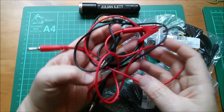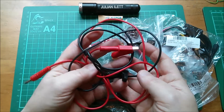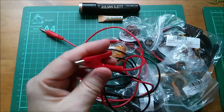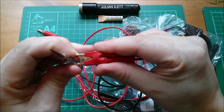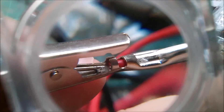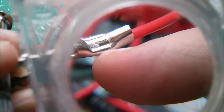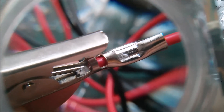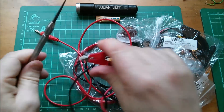Next item is this pair of banana plug on one end and croc clip on the other end leads. I've actually used these to charge up a super capacitor and they seem to work quite well. I'm going to take the croc clip end apart — it looks like it's molded on the banana plug end, but this end comes off. I can see a blob of what looks like lead-free solder, and the crimping is done on the top piece with a heavy duty crimping device. So yeah, it's crimped and soldered. The wire might not be particularly thick — it could even be aluminium — but they're useful and cheap, which is always a good combination.